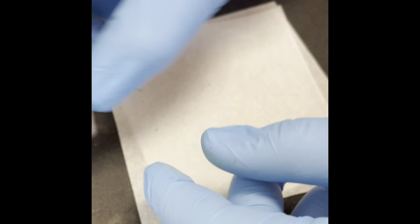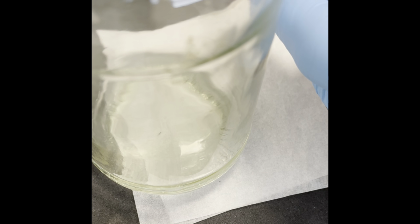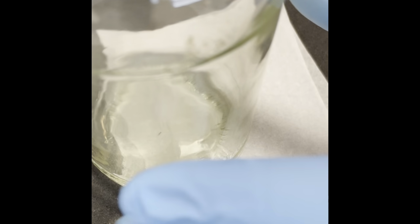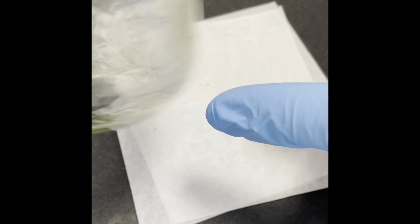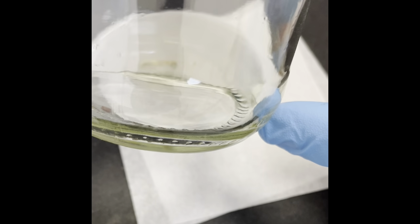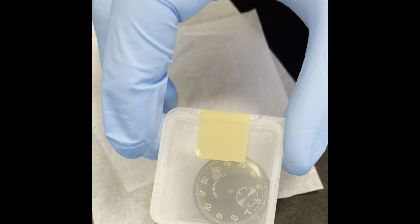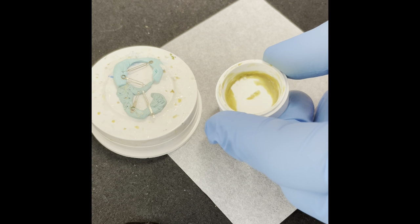With the hands, that stuff is definitely radioactive, and I don't want to get any dust. So what I'm going to do is drop them both into some acetone here. Just simply whirl that around a bit. I'm going to take that out in a little while, and hopefully the luminous compound has just simply dissolved off the hands. Then we're going to apply some new compound and match it up to the dial compound. So my movements in the cleaning machine, getting the full spa treatment.